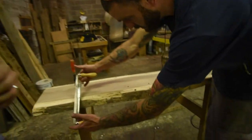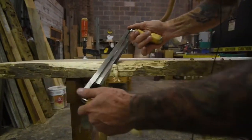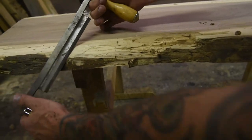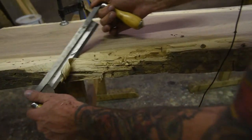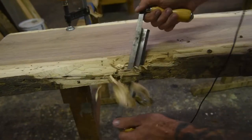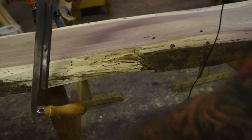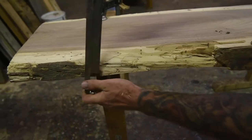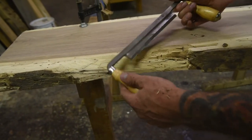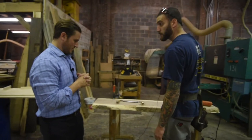You don't want to come across this the wrong way. Pretty much, like Tom said, you pull toward you. You can leave it on a little bit of an angle instead of pulling straight — you get more of a slicing action, almost like a samurai sword. You can adjust how aggressive it is by how steep an angle you hold it. Luckily this sapwood is very soft on this walnut, so we don't have to go super crazy. We'll continue down the whole way to remove everything that's dry-rotted, and then come back in with the Arbortech.